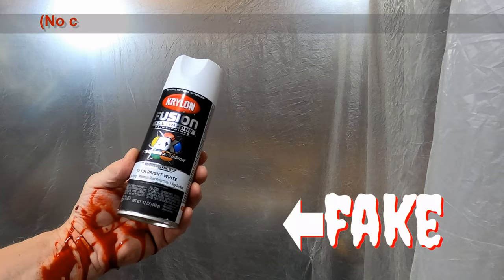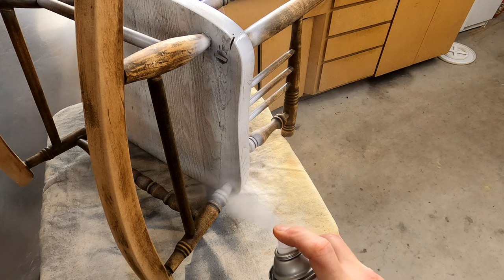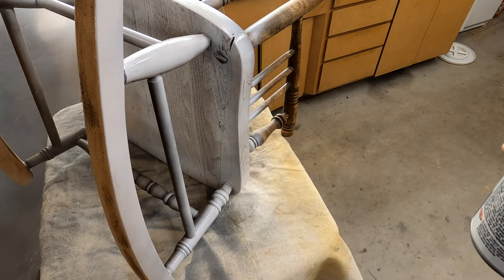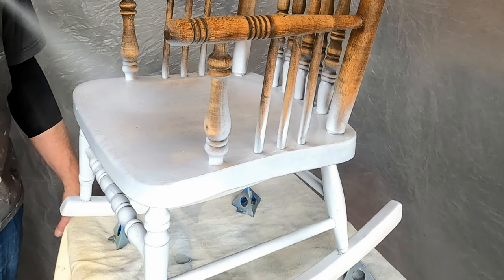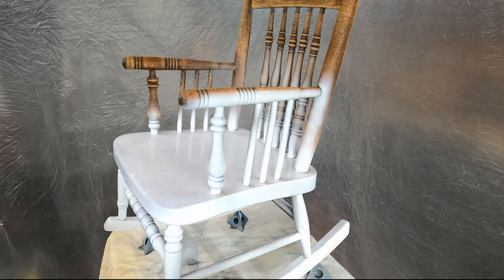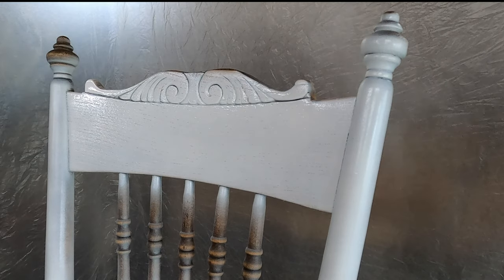For the paint, I took a risk and tried something new — at least new to me — with Krylon Fusion Spray. It's a product that mixes primer and paint, and the coverage is actually pretty good. The surface was prepped with one last acetone wipe down before painting began. It casts a fairly wide spray at good pressure, so the spray head needs to be 12 inches away from the surface or it will just puddle and drip. Because this chair had a lot of skinny spindles and parts, the paint didn't go as far as painting a wide flat surface, so it took a full can to provide a single coat. Most of the spray gets wasted in between all those chair parts — that's not the fault of the paint. The finish seems hard, and the satin sheen will be perfect for the antiquing step that'll be next.